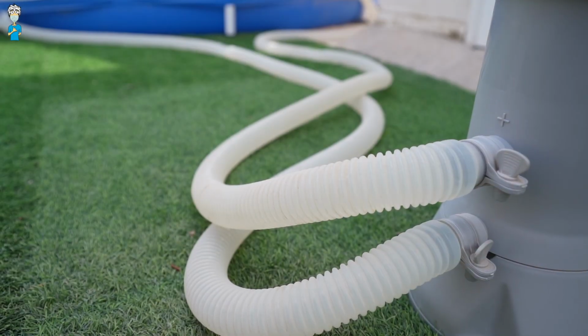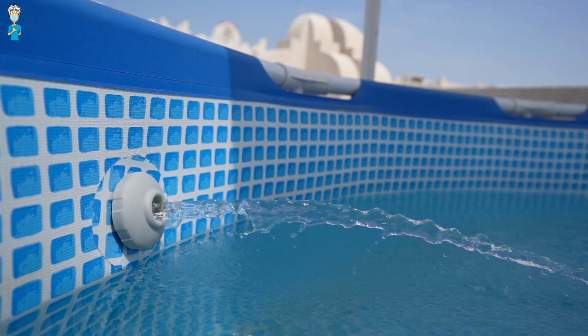So, how long should you run your Intex filter pump, or any other brand pump for that matter? Since I did quite a few videos with practical pool advice, this is the question I get asked the most. Let's answer it right away. So the short answer is 2 or 3 hours a day should really be enough. But depending on your circumstances, the answer to this can vary a lot. So let's go into a little bit more detail.